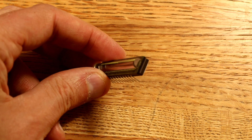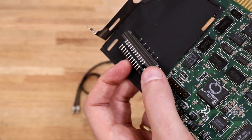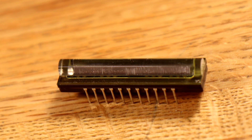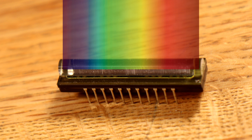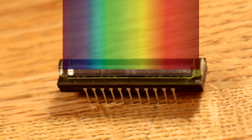The detector is a linear CCD. It may only be a few pixels high, but it's several thousand pixels long. A cylindrical lens is installed on top of the sensor to help improve the performance. Recall that the light received by the spectrometer is broken up into its constituent wavelengths and reflected onto the detector, meaning each pixel of the detector measures a known range of wavelengths or a particular color. Our spectrometer is sensitive from about 350 to 1100 nanometers. Using a detector with 2000 pixels, each pixel is capturing about 3/8 of a nanometer. This isn't quite right because there's non-detecting space between the pixels, but it's pretty close.